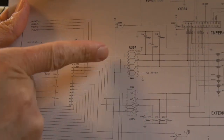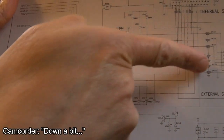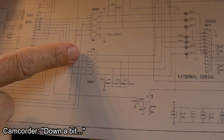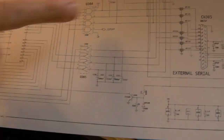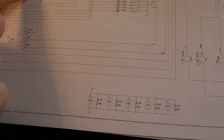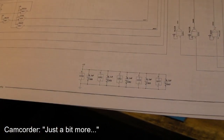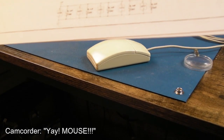Let's just look at the schematics. We've got U301 CIA there, and we've got the 1488 - this is where I was looking at the filter cutoff - and obviously the serial port there as well. The serial port comes in through here, I think U305, but U304 - we've got some of the connections going to the serial port and the filter, and that's where we started looking. In terms of the parallel port, here it is - you've got CIA there for the parallel port.